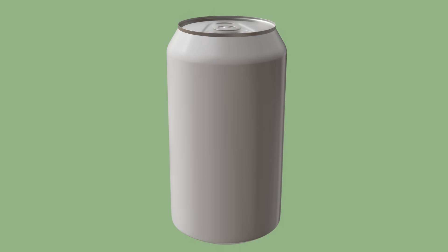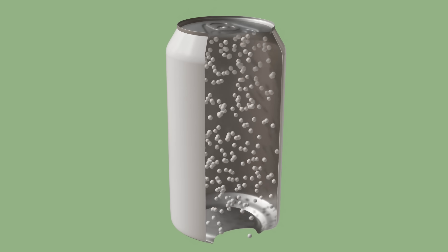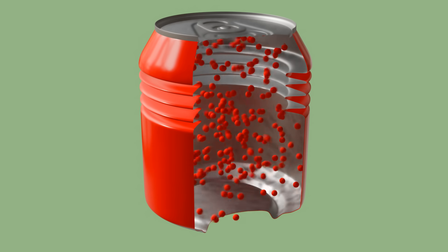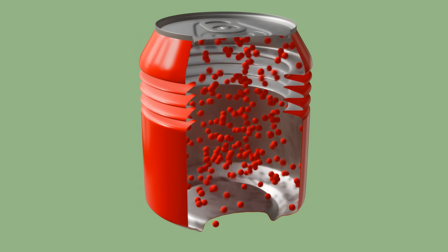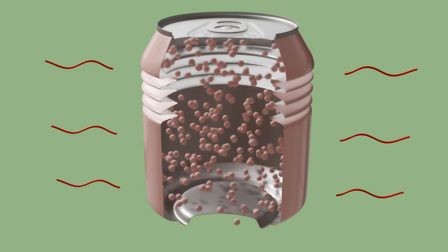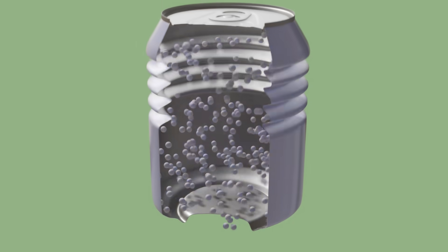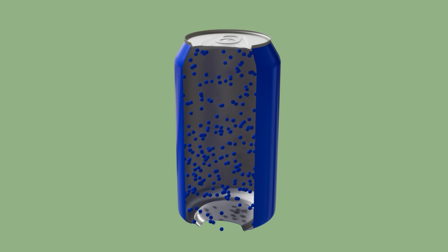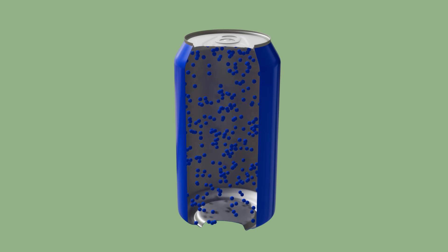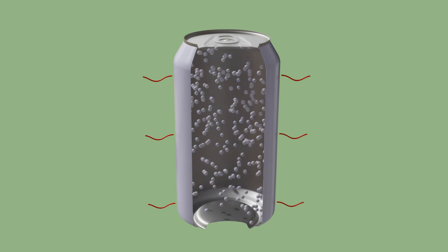This will be a real problem in summer when it's 90 degrees outside and we'll want it to be closer to 70 degrees in here. To accomplish this, we'll have to take a closer look at pressure and its relationship to temperature. Say we have this closed can with a gas inside that's the same temperature as the surrounding air. If we were to quickly crush this can down to half its size, the pressure inside would double and the gas inside would get hotter. Now if we wait, the heat will bleed off into the surrounding air and the temperature will once again equalize. Then if we quickly pull the can back to its original shape, the pressure inside will drop and the contents will become cold, and we'll absorb heat back from the surrounding air.